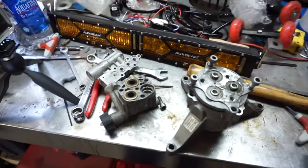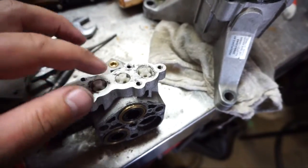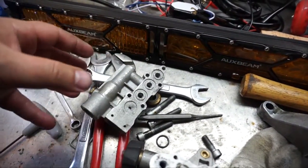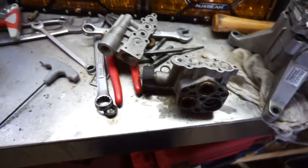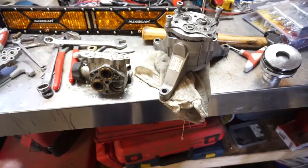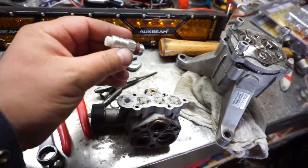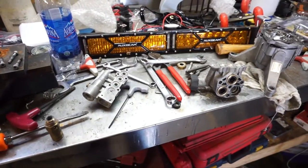For any of you wondering, this would be classified as a positive displacement pump. To recap: water flows through here, gets sucked in here, water flows out through these valves where this creates pressure. The pressure relief valve will control the pressure — if it reaches or goes over that pressure, it is released back in here and flows through again. I think this is like a blowout cartridge, another safety device in case something was to happen, because you don't want to over-pressurize your water line — 200 pounds of pressure to your water line could cause serious damage. Anyways, that's pretty much what I had to show you. If you have any questions or comments, post them below, and I hope you enjoyed this video on what's inside a pressure washer pump.